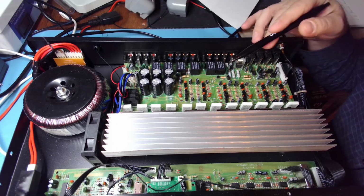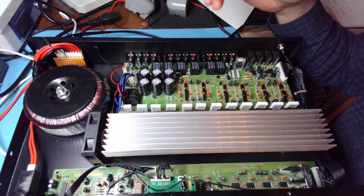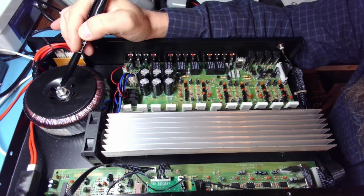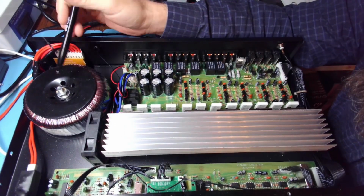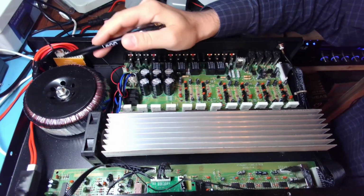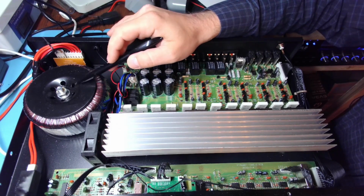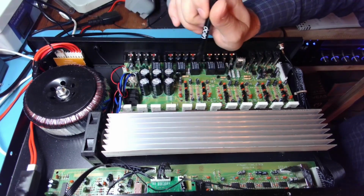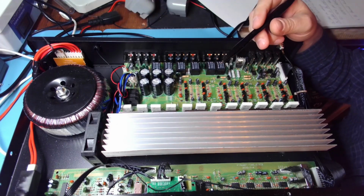Alrighty, let's start with what's great about it, because it's not a bad device actually. There's only four issues. The main transformer is a toroid, so relatively efficient, low noise and all that. It looks to me like roughly around 800, maybe 900 watts of power that you can pull from this transformer, so more than enough to deliver 600 watts to the six outputs.